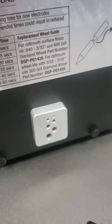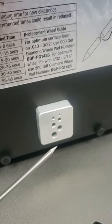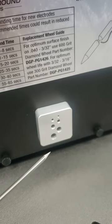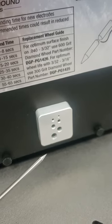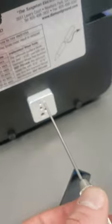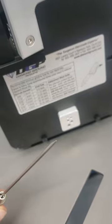The top of the tungsten is a little weak, so what we have right here is a notcher. What this does is it actually takes away that pointed tip so it won't break off into your weld puddle. As the tungsten heats up it becomes really brittle, so we want to get rid of that kind of warped top. So we'll find the 3/32nd hole and give her a little dab. It's actually just a flat top now, so you won't have that busted piece of tungsten flying into your weld and causing a defect.